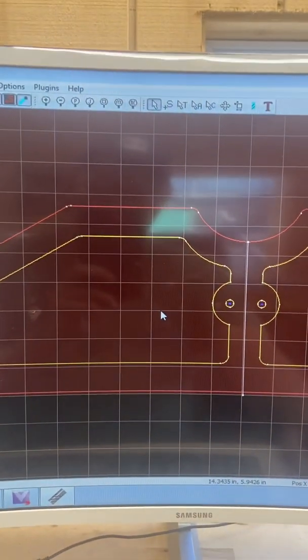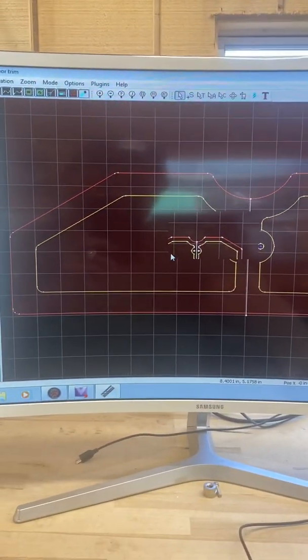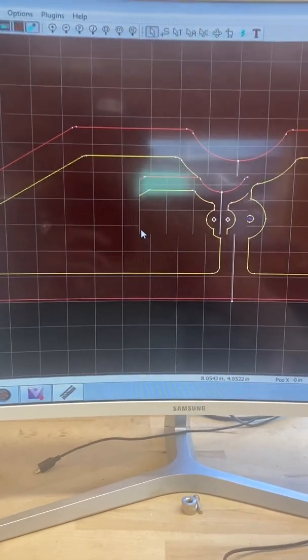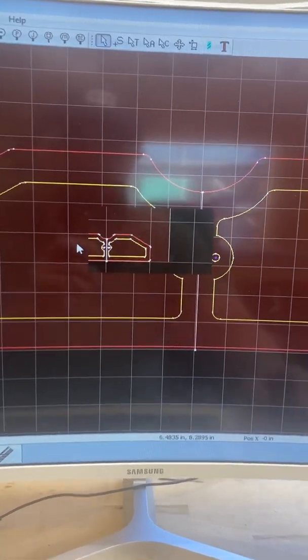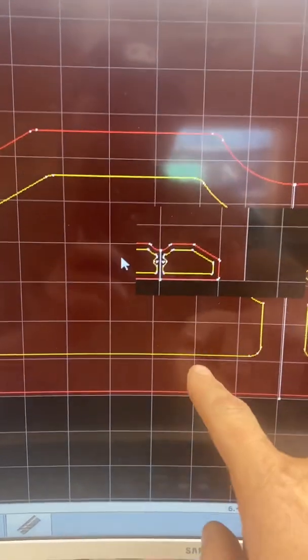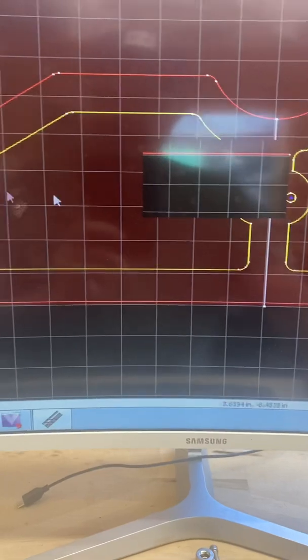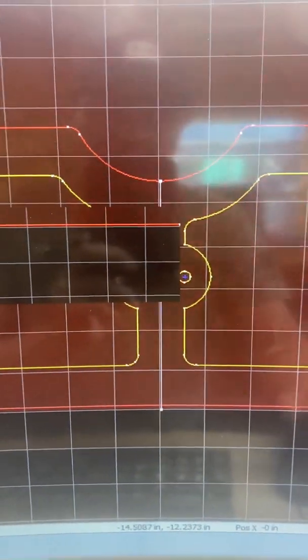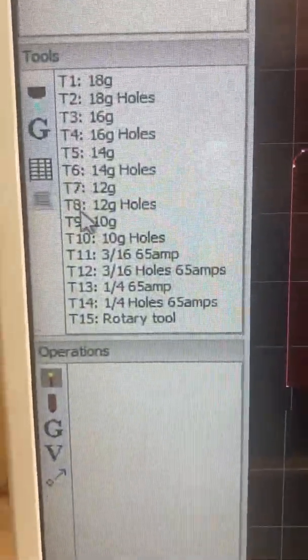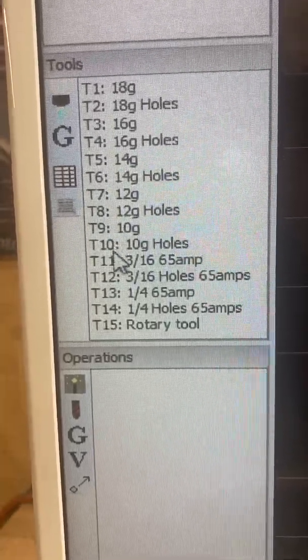It's going to show my drawing. You can click once with your left click and then zoom in and out. Here's my image — what you want to look for is the red line is your outer image, yellow line is inner. On my image I've got some circles where my latches for my handles are going to go. I'm going to go over here to Operations, and what you have here are all your tools — these ones came pre-loaded, so if you're working with 18, 16, or 14 gauge, it's all pre-loaded and pretty accurate.